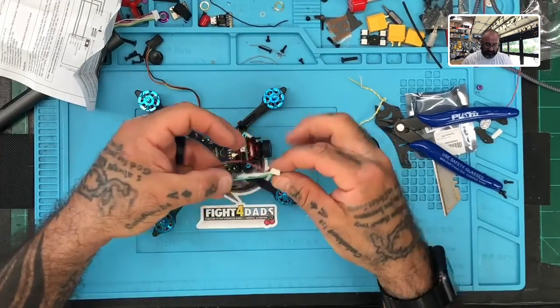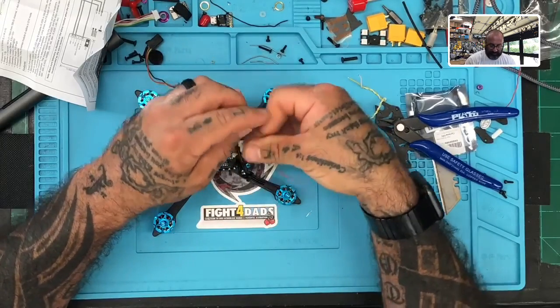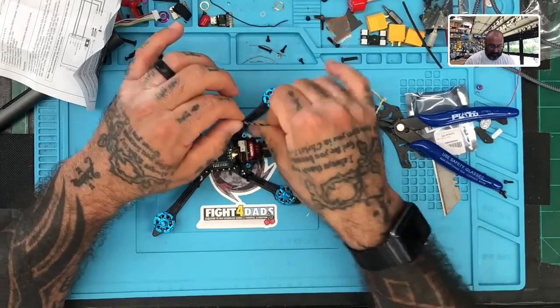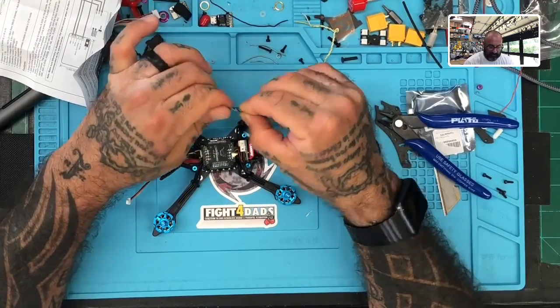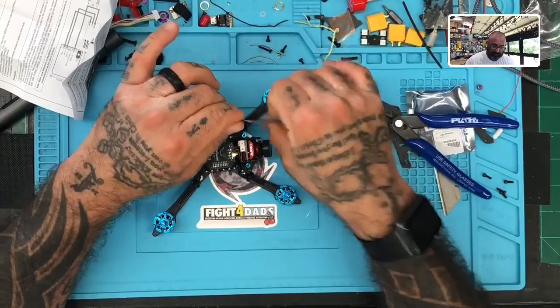What we want to do is go ahead and just link into those. By the way, the wire FrSky uses is awesome wire. When you do cut it, save it — the silicone on these is a really high-temp silicone and these hold up really well when you're soldering.